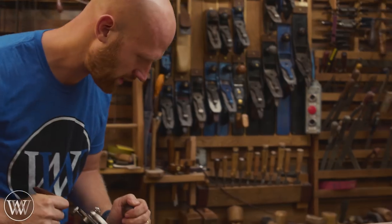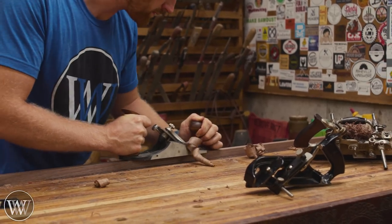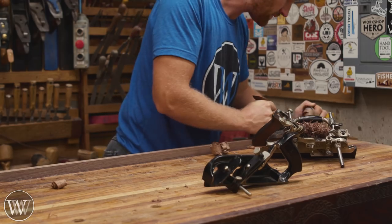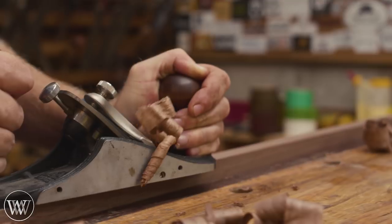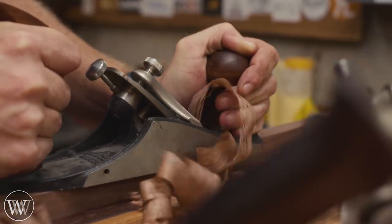This build is gonna start with some walnut. I love working with walnut — it is a fantastic hand tool wood. The first thing I want to do is true up the edges, make sure that everything is 90 degrees, flat, and smooth. It's a good chance to bring in the smoothing plane and really play with it, getting some nice thin curls in this walnut.